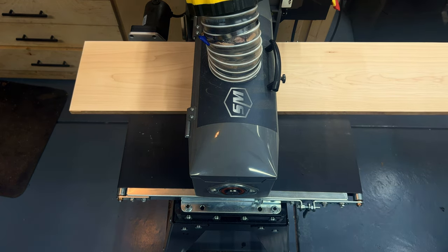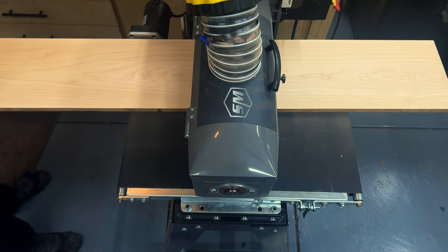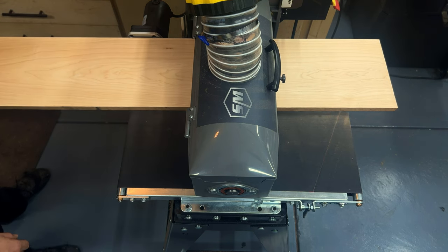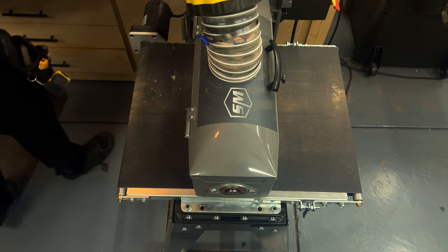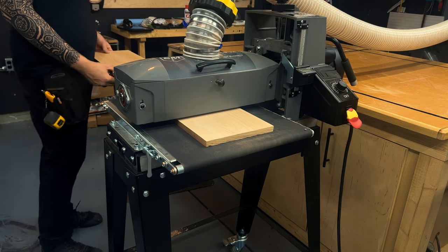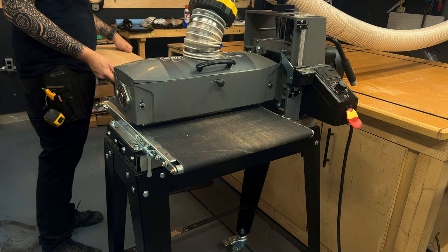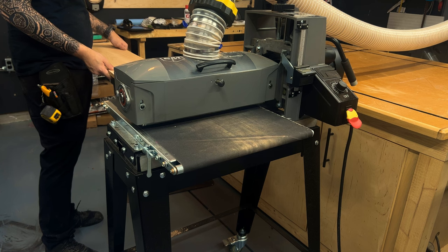You can probably tell that my milling process is a little different than what you would normally see. It's just because I don't have a jointer or a planer currently. I'm waiting on my jointer-planer combo, and I prematurely sold the planer that I did have. I have a drum sander and the lumber is already surfaced on two sides, so I just cut it down at the miter saw, join an edge with the track saw, and then resaw at the bandsaw. It's worked so far, but I wouldn't trust it for bigger projects.